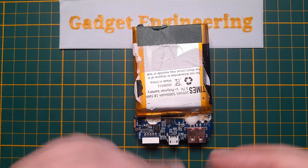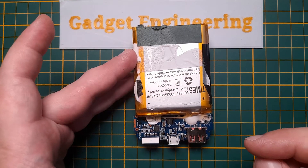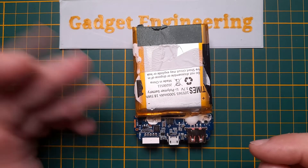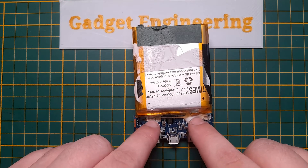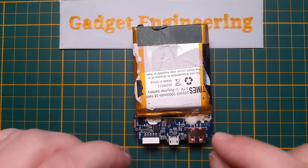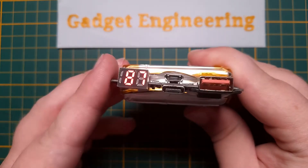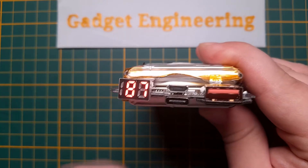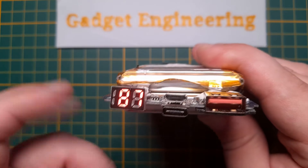After doing that, there were no sparks. Most power bank batteries are fairly low current anyway — they're designed for high capacity rather than high current, compared to something like drone batteries. Shorting those plus and minus incoming ribbons for just a short second allowed the MCU to restart. As you can see now, it's working perfectly and the full 18-watt output is able to be deployed once again.